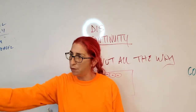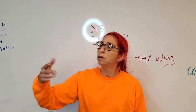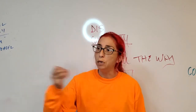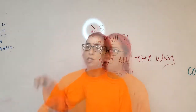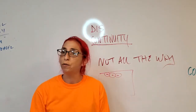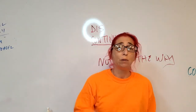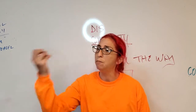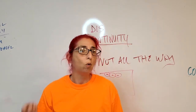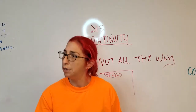Okay, so follow that back a little bit more. We don't have enough penetration, we don't have enough fusion. Voltage or amperage, right? We need more heat. We need to apply more heat. Now remember, this doesn't apply exclusively to stick or anything else. These apply to almost every process. If we don't have enough heat to properly melt everything, your weld will fail, okay? So we want to make sure that we're using the correct amount of heat, right?